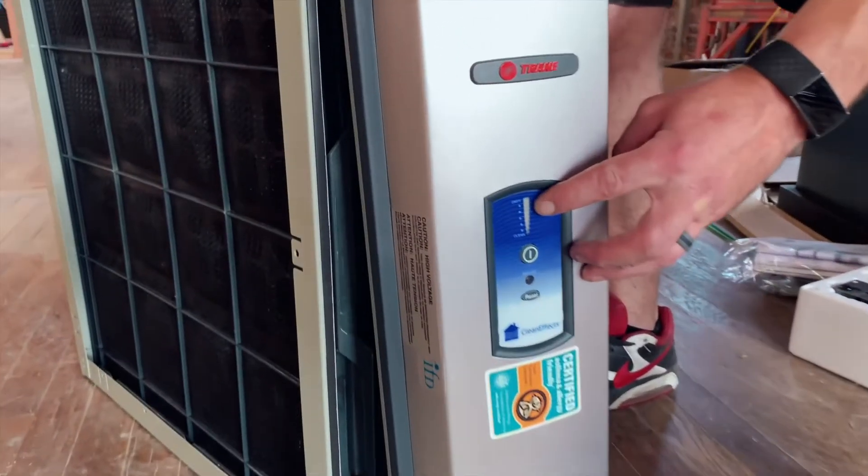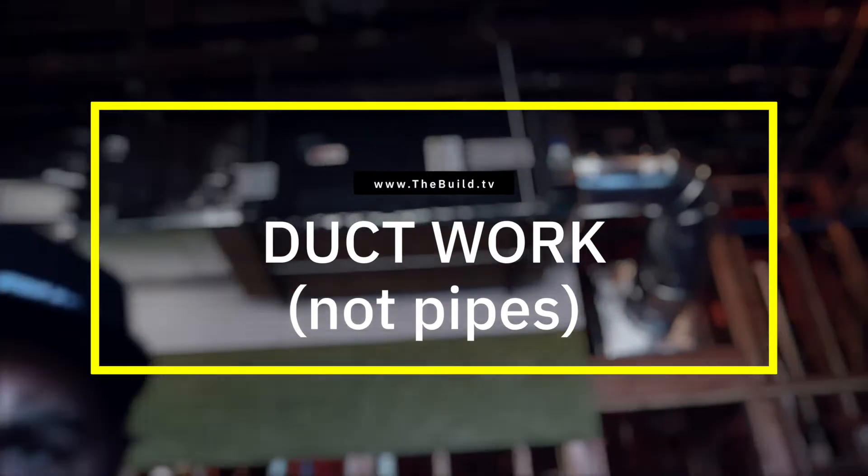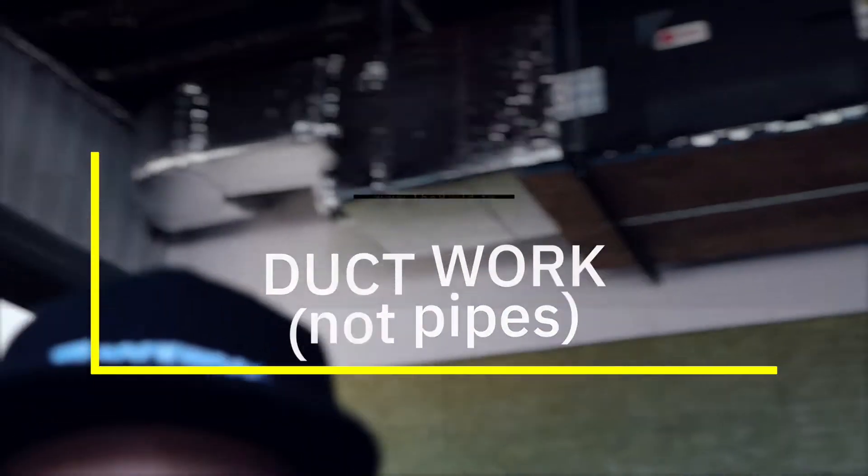There is nothing that's going to do it better than this. These units run super quiet — you almost can't tell when they're on. The other thing that's great is it's all double wall. As you can see around the pipes here, my HVAC guys are insulating all the piping, because when you have cold air running through there in the summertime and it's hot outside, you can get condensation and it's going to drip. Because the Trane Hyperion unit is double wall, you're not going to get any condensation whatsoever on the outside of the air handler itself.